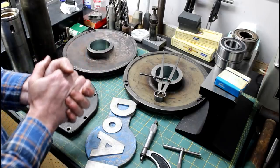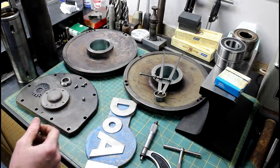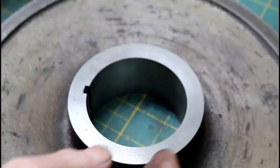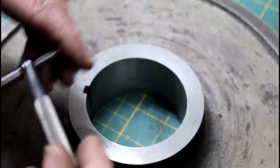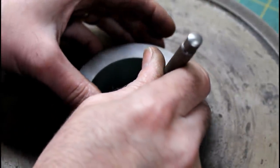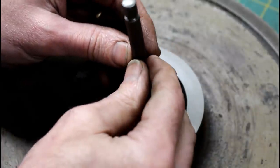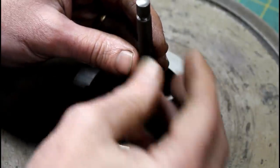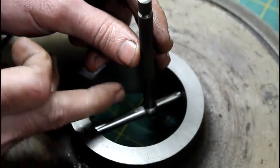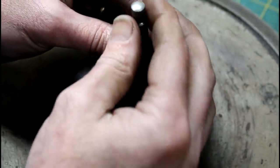now. We need to bore it out to slightly over 2.8 inches, and then maybe we'll start working on our center hub here. So on my pulley halves here, to measure these bores in the lathe, of course I used the telescoping gauges, just the best instrument that I have to measure a bore of this size. Using these can be a little tricky if you're not careful, because the amount that you tighten this, the way that you rock it out, whether it's centered or not, it all plays in the final measurement. So you want to take several measurements with them.